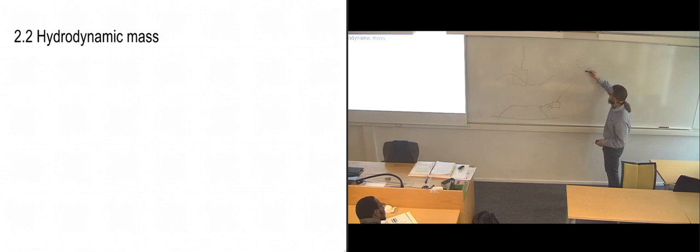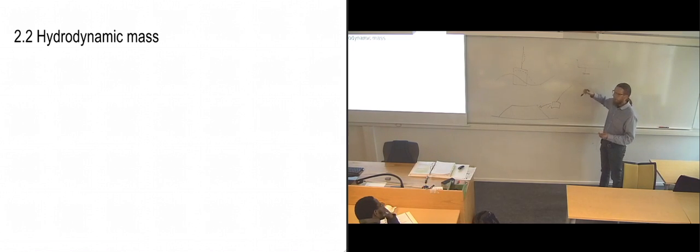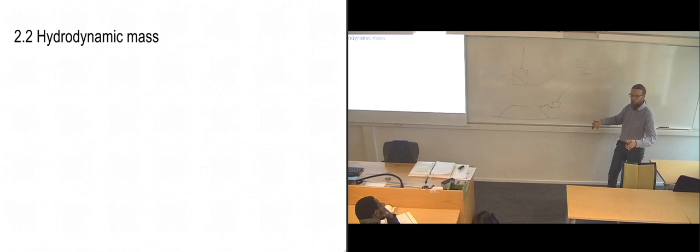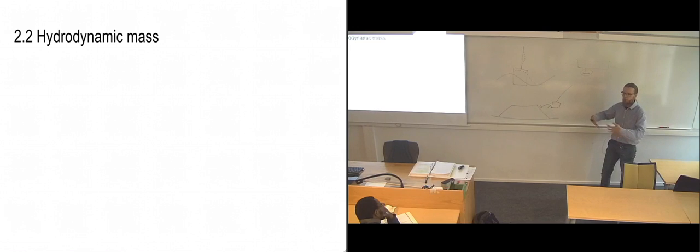But underneath it, it has almost like an airplane wing. So that's the hydrofoil. And when it speeds up, this is going to lift the entire hull up from the water, so that basically only this part is going to stay down in the water, and then you have the engines and everything. So it's going to lift up the hull, and that way reduce drag, because then it's only this sleek, very dynamic wing that's moving through the water. So it has very little drag on it, while the hull itself, when it's moving slowly, has much more drag.